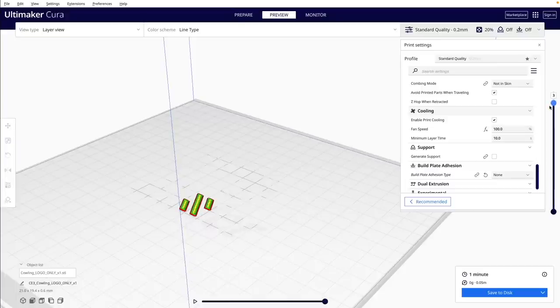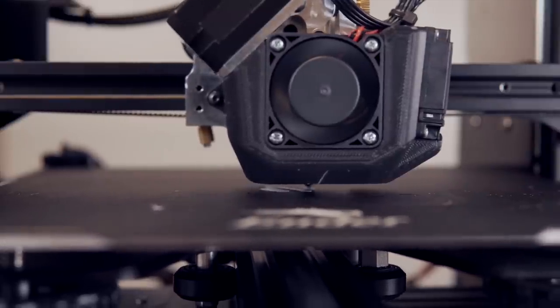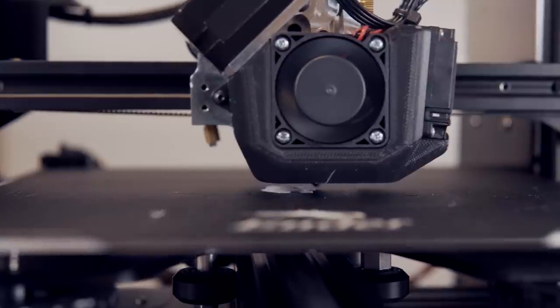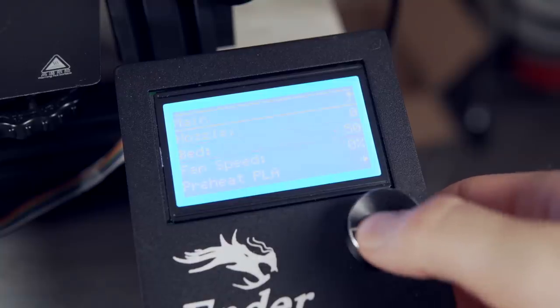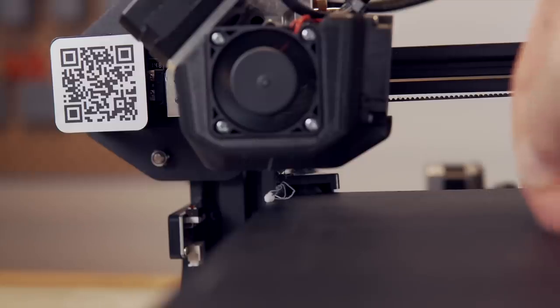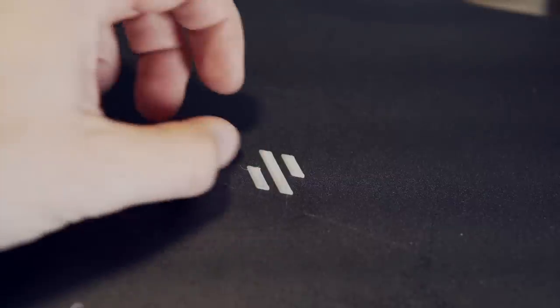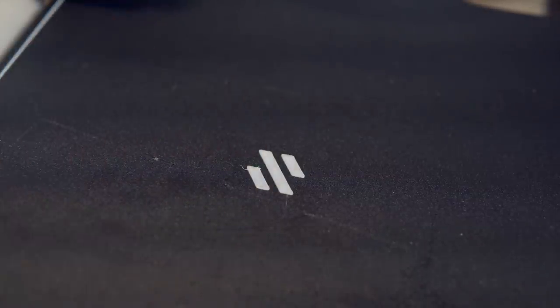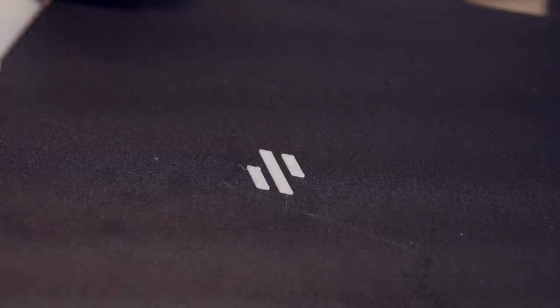The logo is three layers tall at a 0.2mm layer height, so I know the total height is 0.6mm. Next, I load the sliced part onto the printer and print it out in the color I want for the logo. When the print completes, I leave it on the build plate, set the heated bed to stay on to help with adhesion, and swap out filaments for the color I want the tool head to be. I always disable skirts when doing color swaps, but if you didn't do that, you'll want to remove any skirts or extra material on the bed and just leave the printed model.